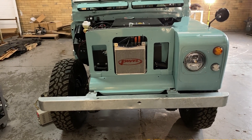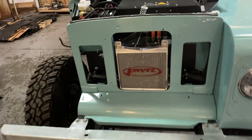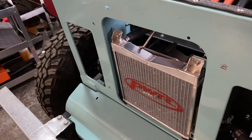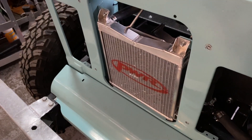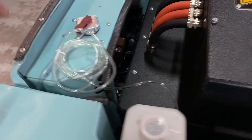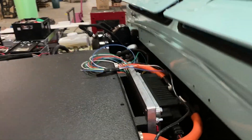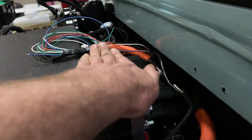With the cooling system mounted on the car you get an idea of how small it is in context — just this small radiator, though it's bigger than what a lot of other people use on EV conversions. That means we can guarantee it stays cool, running the fan at lower speeds or not at all depending on temperature. The coolant runs out of the pump along these two aluminium pipes mounted down here and back into the chill plate on the motor controller. This is shown just without its final cover.